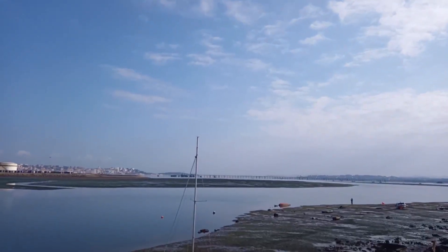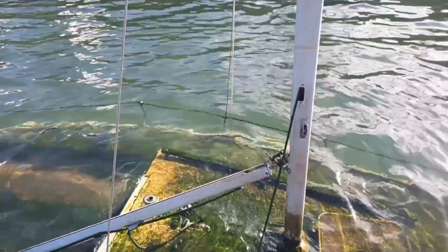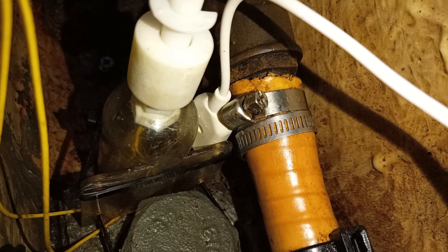The worst thing that can happen is for the boat to sink simply because we didn't realize it. Considering that most of the time it will be a very small leak slowly flooding the boat — and many leave it for days or weeks — for just six dollars we can have a system that alerts us if there's water, allowing us to react and potentially save the boat. On slightly larger boats you can even install more than one sensor to pinpoint where the water is entering — distinguishing whether it's rainwater or water entering directly through the bilge. As a result of making this video, I've also taken the opportunity to automate the bilge pump, which in my case wasn't automatic, using those float switches and the relay.